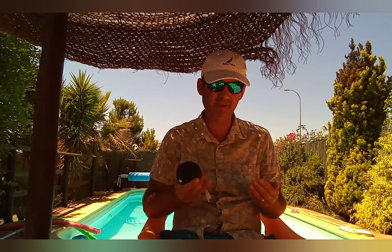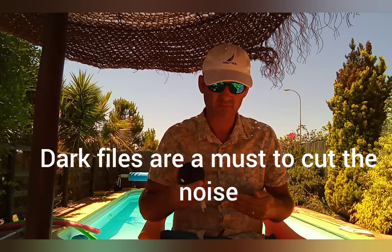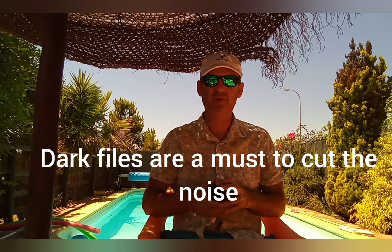Something to cool the camera, just not to allow it to go above 30 degrees Celsius. It's too much. It can work like that, but it will introduce lots of noise, and the dark will have, with the software, a hard work to clean that, and I prefer to make my observation with lower noise. So that was my purpose.